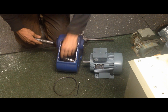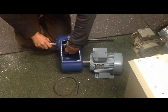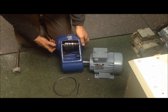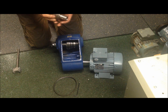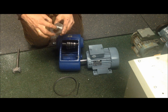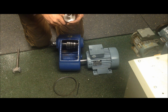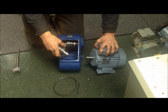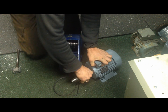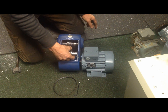Turn it around. The bearings should be on this side, which should be pressed in. On the other side, going to the motor, we have a fastening plate, a mounting plate. First of all, I pressed this 16mm axle adapter onto the 19mm hole here — it should then go into the motor like that. It's tight. Then in here with the drive belt there.